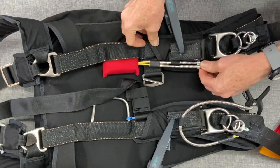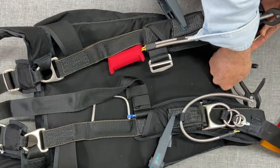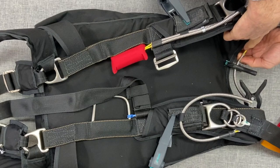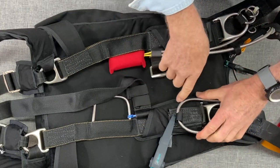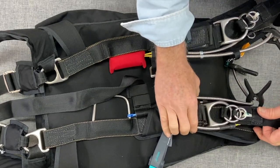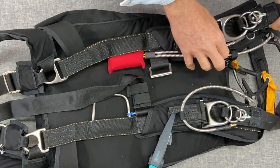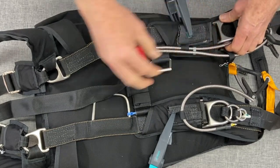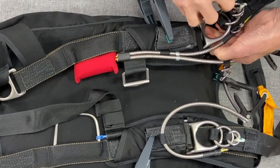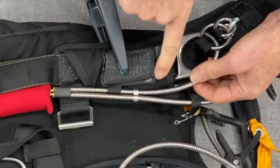It can't go down too far, can't go up too far. As it moves around in between these pieces on the Vector and the other rigs, there's a split here on the left-hand side going to the left-hand side for the Collins lanyard. Round it comes, it drops down and there's another support tape, allowing this as well to float safely and not be tied down. In the past, I've seen somebody who was worried about it being loose, so they used a cable tie and wrapped it around — it actually pulled the end of the housing off. Let it float, please.